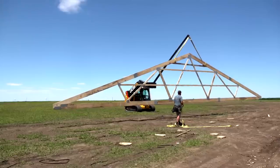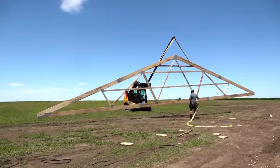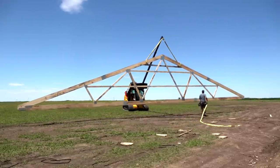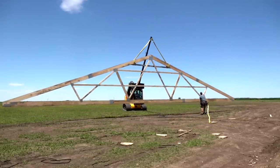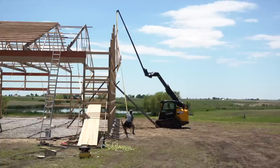All right, guys, thanks for watching. As you can see, we got those trusses up there. I will tell you that I think 60 foot wide, 14 foot sidewalls is probably the max that I wanna put up with this setup. I could extend my boom a little bit further, but that's a lot of weight when you get it out there. And so if you were watching, I was getting that boom as straight up as I could. That way, most of the weight was coming straight down, but it worked awesome.